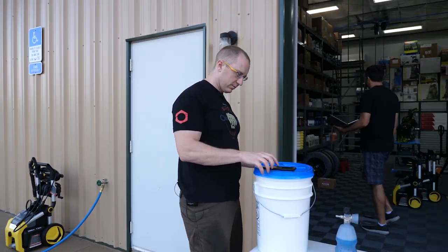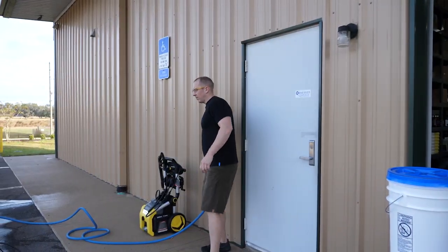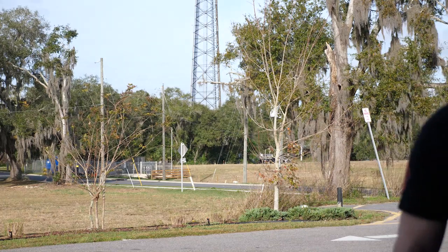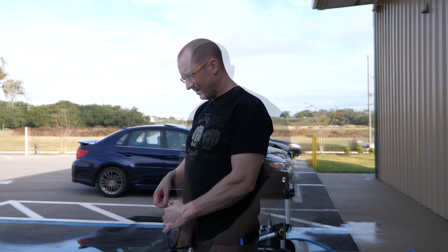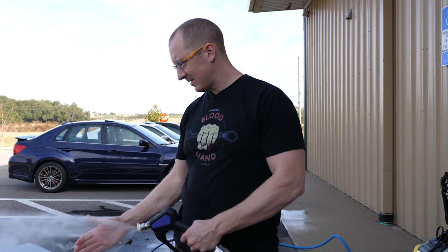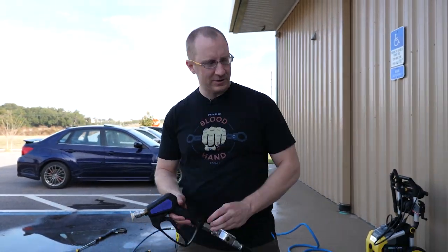Right at 15 amps — 14.8. Flow: 1.2 GPM. With the aftermarket nozzle: 13.5 amps. Only 1.3 GPM change — 1.28 GPM. With a 3.0 nozzle we only get about 875 PSI, so we go with 2.5 instead. 1200 PSI — that's really good, actually. 2.5 it is.